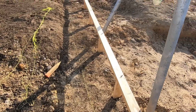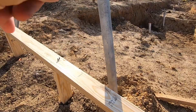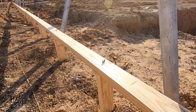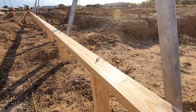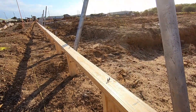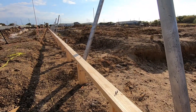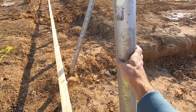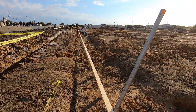Next, what they do with the dome is they have those helicals going into the ground, then they form up this beam that runs all the way down. This is what the concrete is going to be shaped around to form that beam going all around the air-supported dome, which is basically a big rectangle. It's going to ultimately connect into these helicals to make sure it's all got the foundation that it needs.